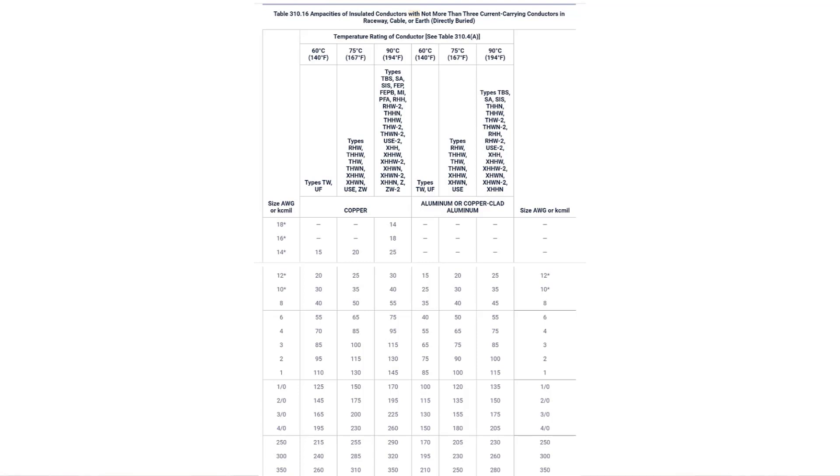For all motors, number six wire is a 65 amp rating at the 75 degrees Celsius column. We may put this on a 200 amp breaker, but you don't want to choose ampacity for the breaker yet — not yet. This is just for wire size. They may tell you to use THHN with 75 degrees Celsius, and you're going to choose the wire size based on the 75 degrees Celsius column. So remember that.